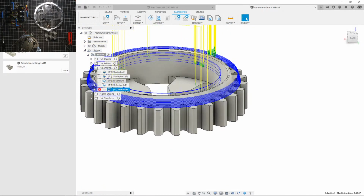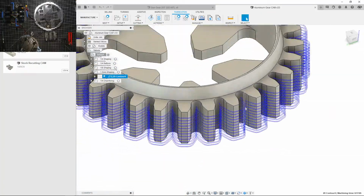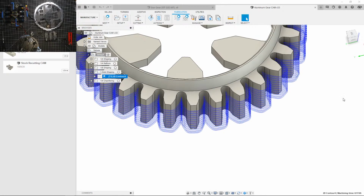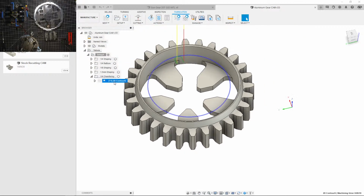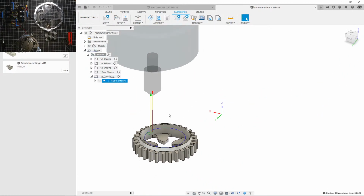Okay, next, that's done. Oh yeah, here's this. So this is when I'm doing the fine details. See, I did it in layers or passes, with step overs of, wow, that's really small. Now I do want to change the speed on this because I was able to crank it up to like 200% speed, so I'm going to multiply the feed rate by 2. Oh, chamfering, yes. That's a 1/4 inch. Did I use a 1/4? Oh yeah, I did. I have a smaller chamfer tool now, so I'll be using that.